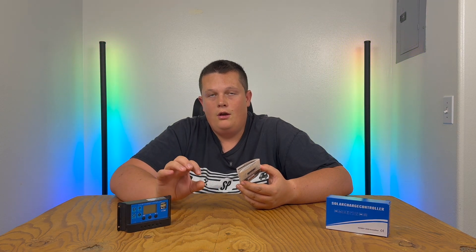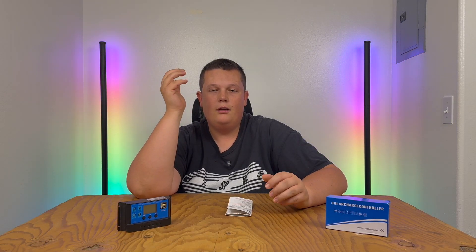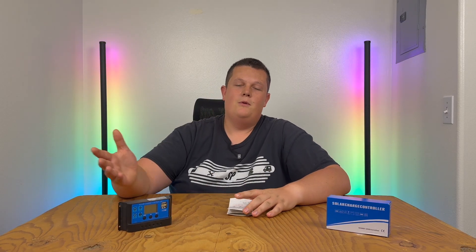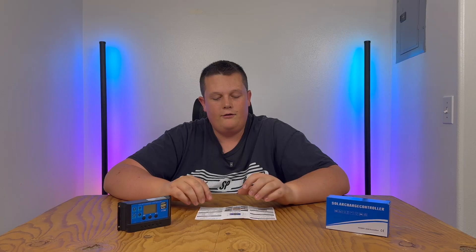If you set a high enough discharge stop voltage and don't have a large battery bank, as soon as the sun sets and stops producing power, the controller will cut the load off to prevent battery damage. It won't start running the load again until the sun rises and recharges the batteries — same applies on a cloudy day. Anyway, that's what we're talking about today. I hope it was helpful — just translating this manual into some useful directions. Please let me know your thoughts. Thanks for watching and have a wonderful day.